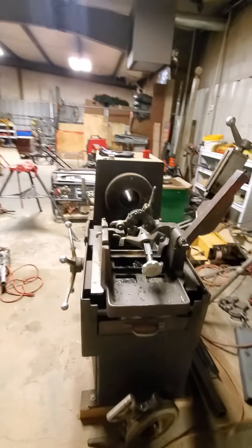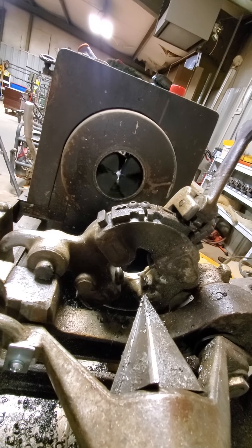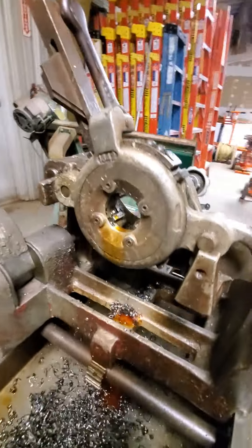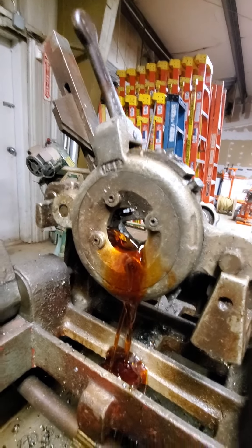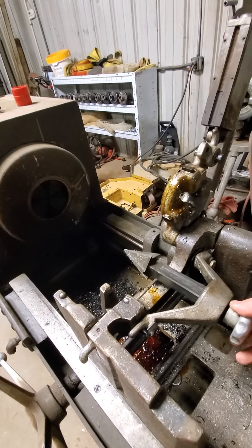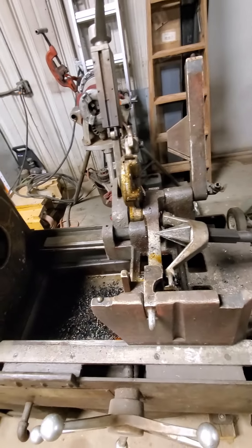This will thread up to four inch. That's an automated threader. When you turn on the button, it locks down and starts automatically spinning the pipe. Hit another button to unlock it. And when you're running it, it oils at the cutting head. It also has a built-in reaming tool. This machine was built back in the late 60s, so it doesn't lock like it's supposed to — you kind of have to play with it to get it to pop in place.